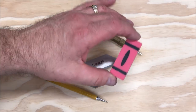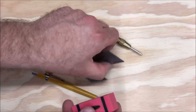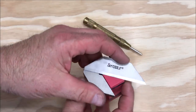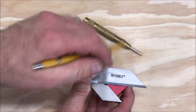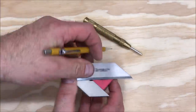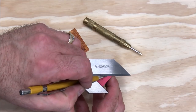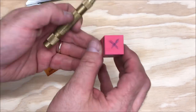For this blank to work I need to make sure that I drill perfectly down the center. So I'm going to use my center finder — I got this from Tay Tools, and if I can find the link I'll put it in the description below. It basically sits on your blank like this. You take a pencil, make a mark, and then rotate the blank and continue to rotate until you have marked all four corners. Now you can see dead center of your blank.